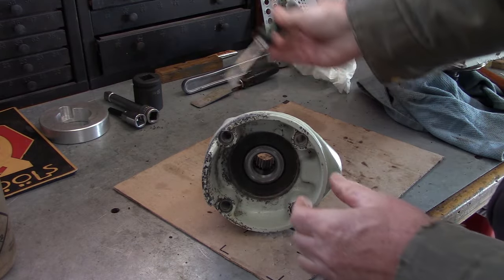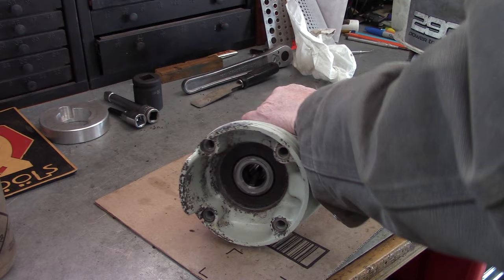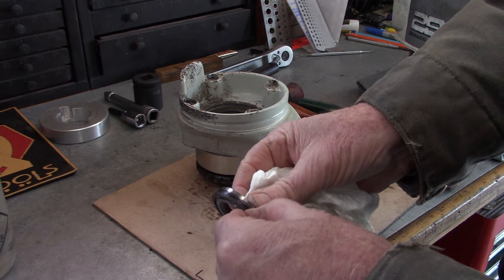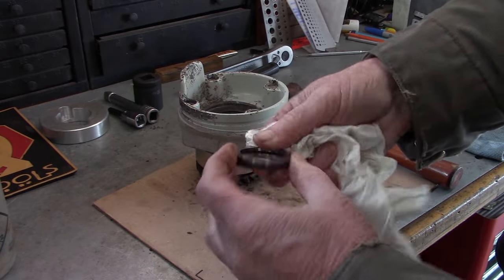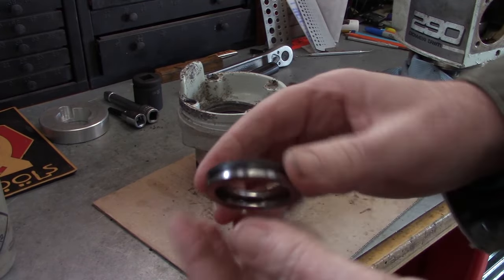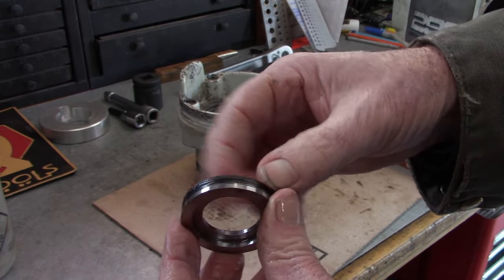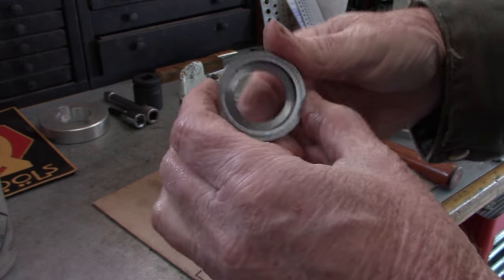Next we've got to remove the sealing ring — I think they call it a shoulder washer. There's enough of an edge there that you can just catch it with a screwdriver and carefully tap it out. Don't overdo it — you don't want to nick anything up. You want to inspect this for wear. This one's got a lot of wear; there's a pretty deep groove in there, so I'll probably be replacing this. I tried to clean it in some solvent and what initially looked like grease and dirt buildup is actually rust — it's swollen up and there's a pretty good groove into the seal surface. We're going to replace this.